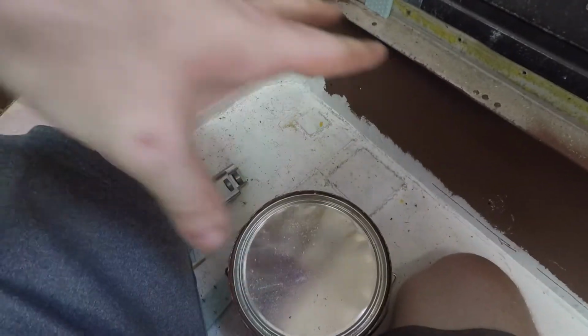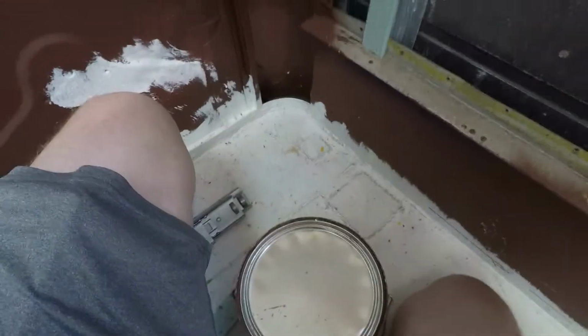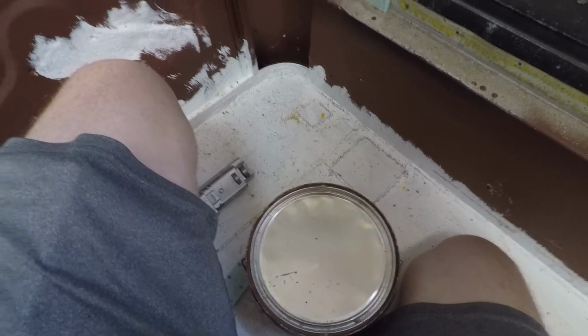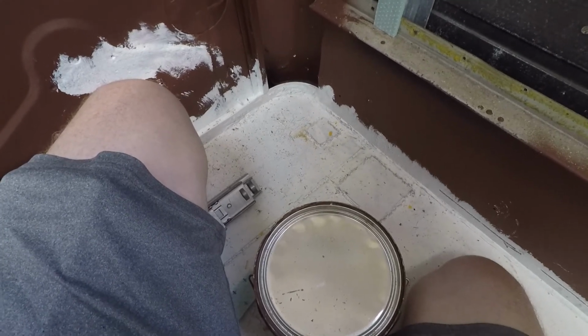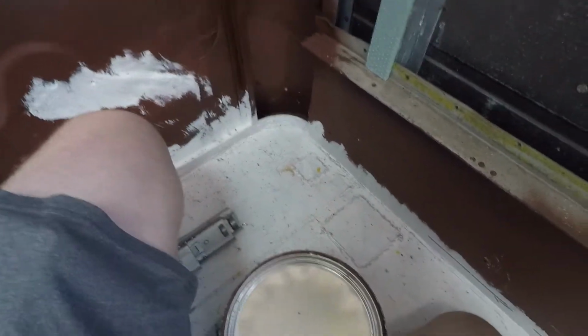The subfloor can be screwed into the 2x4s, and then between the 2x4s I'll put 2x2s, and that'll be just to support the subfloor so it doesn't bow. And I can screw the subfloor into that 2x2 because I only have to screw one. I don't have to screw 2 sheets of subfloor.